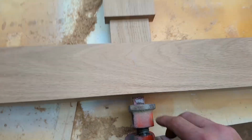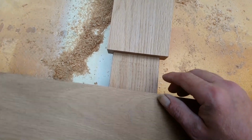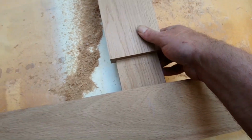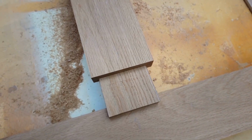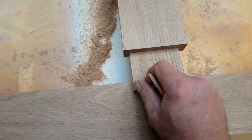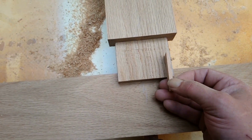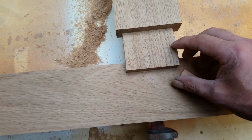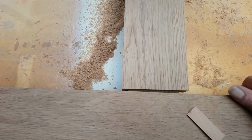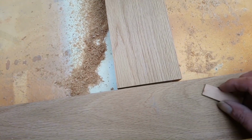These tenons, when I do stopped tenons like this, whatever you call them, stop mortises, where they don't go right through, I normally put two little cuts down here, and then you put some wedges in, and when it closes up inside there, it spreads these pieces and locks your tenon in place. Problem with that is you've got to get them exactly the right size, because otherwise you end up with a tenon that ends up stopping there because it's all jamming up inside, too wide, too long.